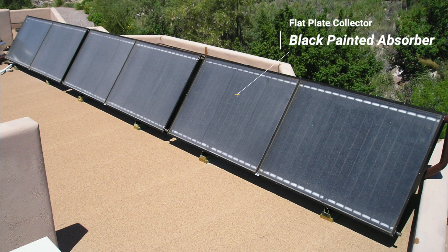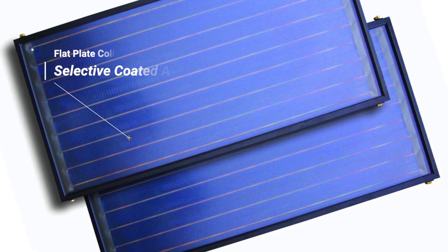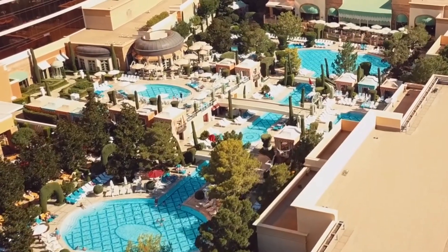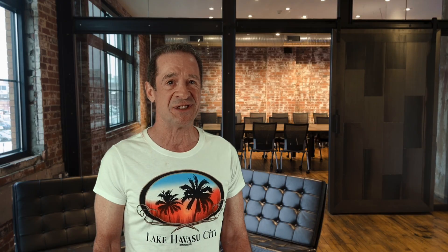To explain how to match up the system with a more favorable collector: in hot climates that see over 100 degrees Fahrenheit or 40 degrees Celsius day after day for months at a time, flat plate collectors with black paint absorbers are a perfect choice. They are the least expensive glazed models and are better heat dissipators when it's scorching hot outside. The system wouldn't need a selective-coated absorber that adds to the expense. Unglazed plastic collectors could also have been a viable option, just as they were at the Palazzo's 200,000 square foot collector array on the Las Vegas Strip, which heated the resort pools, spas, and hot water. Another solar option for hot desert climates are hybrid PV thermal collectors. By cooling the PV collection surface with a thermal fluid, electrical output from the panel should remain stable even in the hottest of outdoor temperatures, while making hot water.